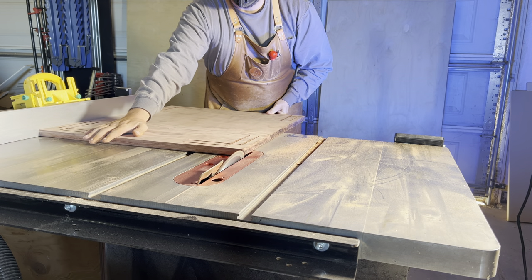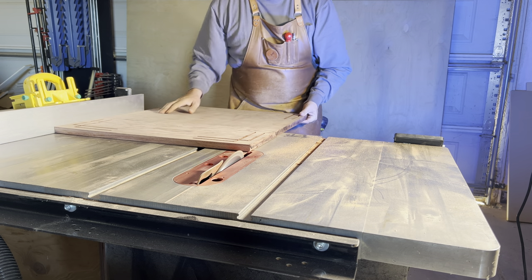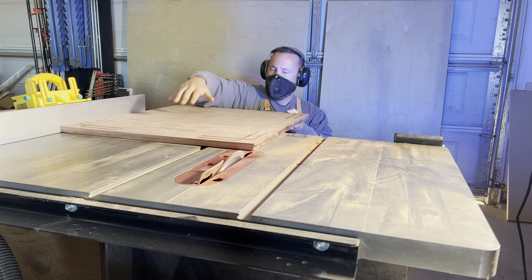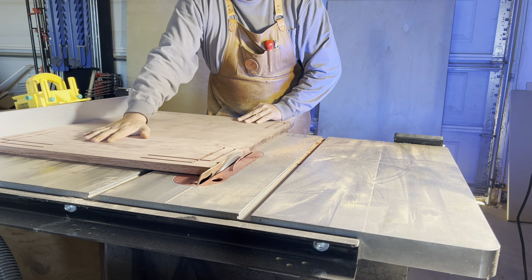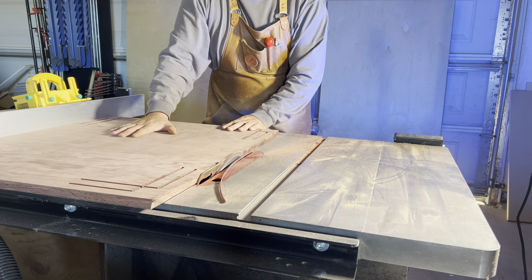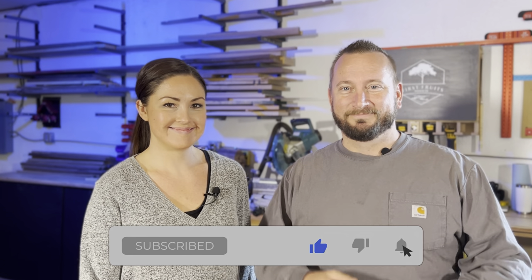When it comes to cutting the remaining sides, we need to ease into that cut so that the chamfer lines meet up. We'll make an intentionally wide cut and then just tap the fence until they line up nicely. Once it meets up, we can leave the fence where it's at and then make the remaining cut. And if all of our layout and mathing was correct we will be good to go — mathology, it's science.